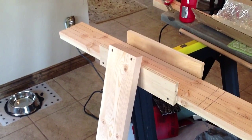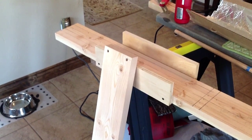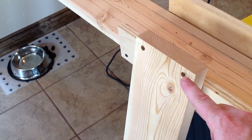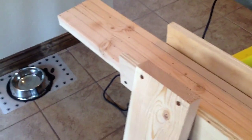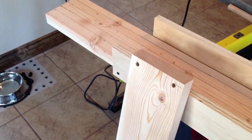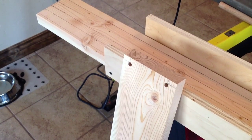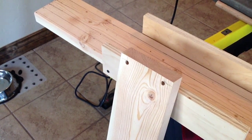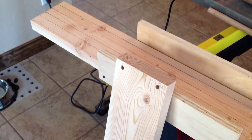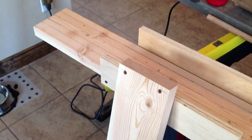The key to my flattening jig setup, as compared to Nick's setup, is I added a few things and changed a couple of things up. You can see on the board here where I had holes drilled for the screws and bolts to go through based on Nick's design of the adjustable flattening jig. I had a hard time getting both bolts level with the wing nuts and the nut underneath — probably me and my old age and operator error, so to speak. My goal was to remove some of that and create a more flexible setup that was more consistent.